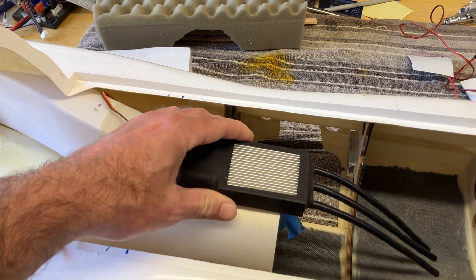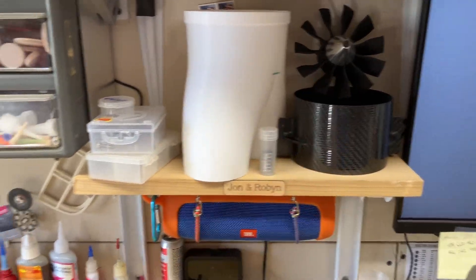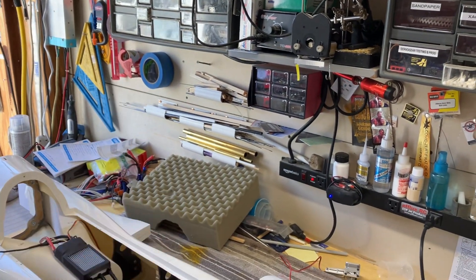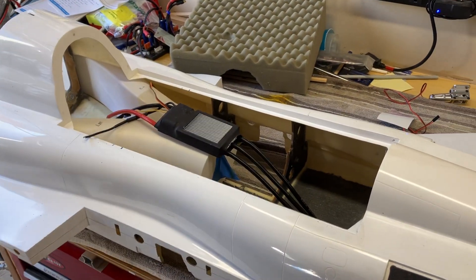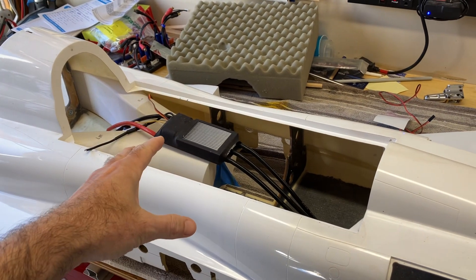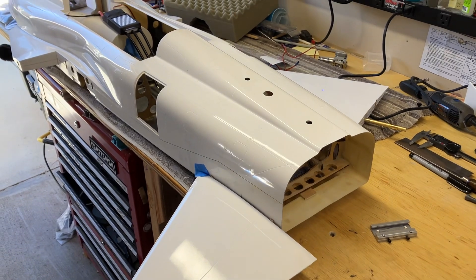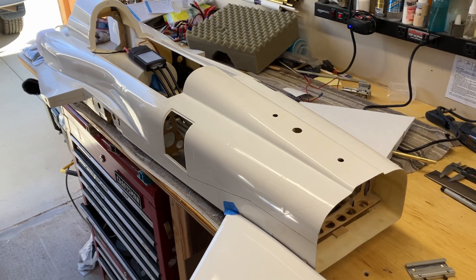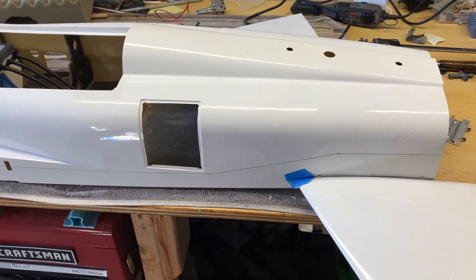The other thing I need to do right now is get a test stand set up for the fan. I've got my scale over there, and I want to check thrust using a couple of these bifurcated exhaust tests. I'll probably start on 12S then move up to 18S, and mostly just get run time on the system. I want to make sure the ESC temperatures stay reasonable and the motor doesn't overheat — this is a 68mm length motor, which is kind of small for 6,000 watts, so I'll definitely be putting a heat sink on there.